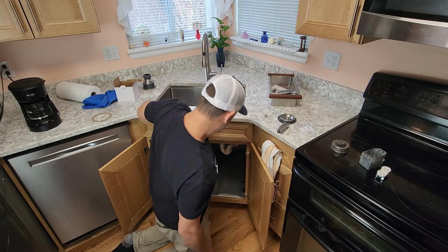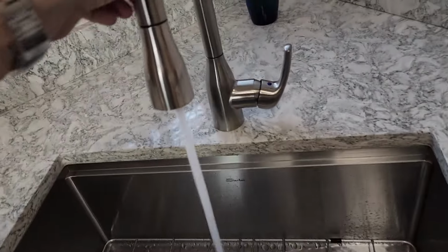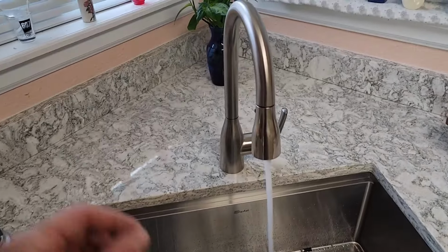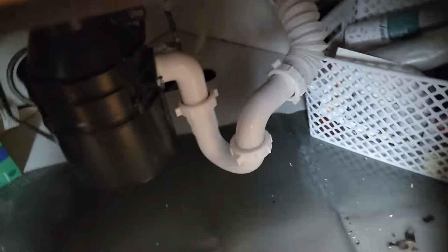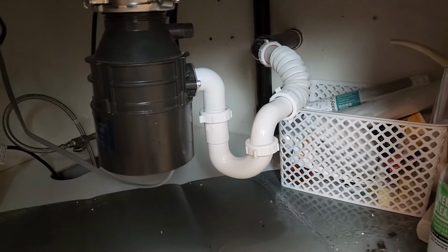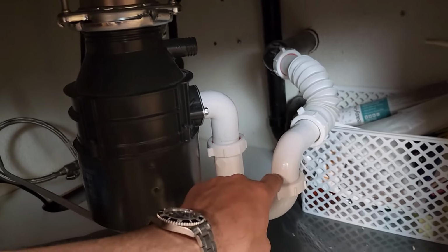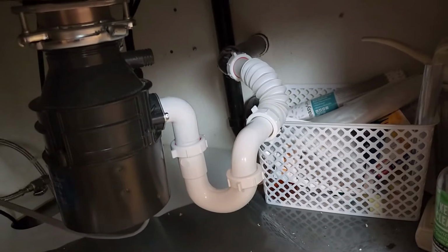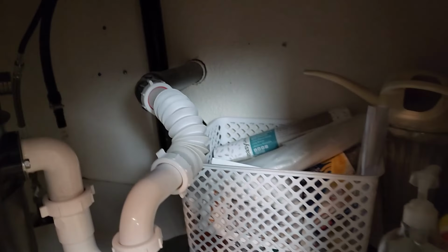All right. I'll bring it down. We'll look together. Looks nice. I just noticed that the plastic, the gaskets were just not normal, especially on the supply lines. I don't have much light to work with in here, but as much in as possible. So this has water. This has water, this has water, and obviously that one has water. Slip joints hold back water. They don't hold back a lot of pressure, but we are making water run uphill and out that drain.